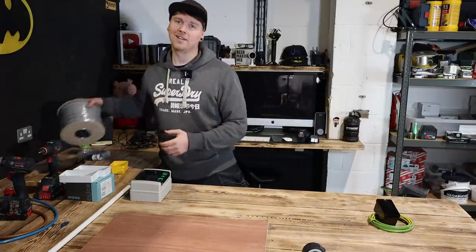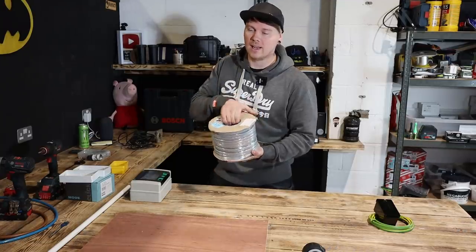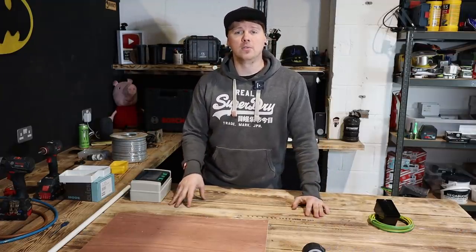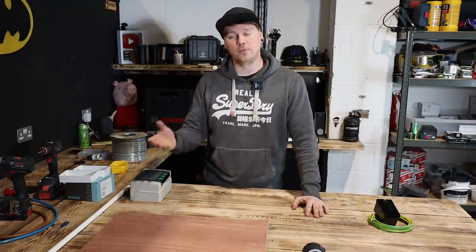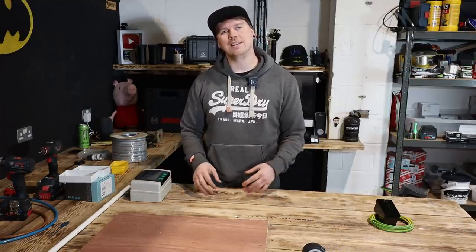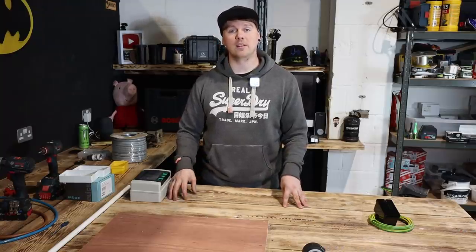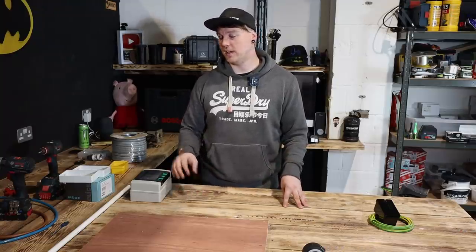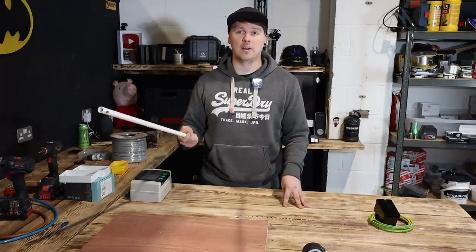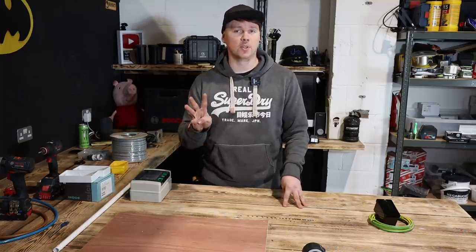For the first time ever, I bought a drum of 4-mil cable. The reason is I don't normally use 4-mil — I've said it across the channel several times. But people keep asking why I'm not fitting 4-mil so we can run it up to 32-amp. I've just never really seen the point. It's a bit more of a pain to work with, especially fitting into 20-mil oval conduit — two 4-mils will not fit at all. But I've bought some, and it will allow us to have a 32-amp supply to the four double sockets.